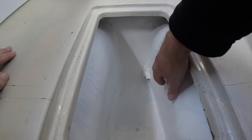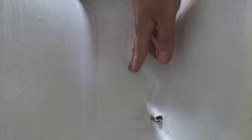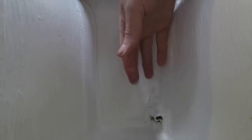I was able to do that because I took care of the cracks. I ended up talking to 5 separate shipwrights, and they all agreed that the cracks I had in this big blob of thickened resin weren't a big issue, not in my case at least. So I think I showed you in the previous video that I put a nice bevel on the cracks. I filled that up with thickened epoxy after it had dried, and then I painted the entire bilge with 4 coats of 2-part epoxy primer.